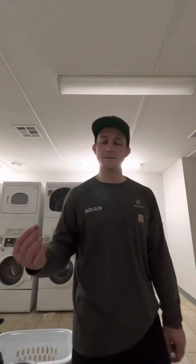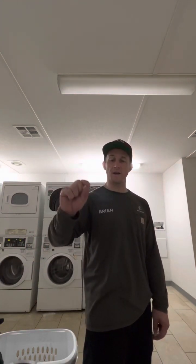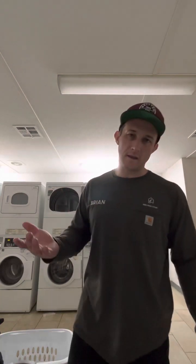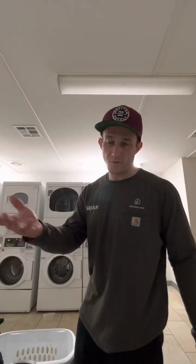Now do the same for the 120/240. Add it all up. Say you come up with 1,000 watts. You're going to do 1,000 divided by 240. That's your amperage; the answer will be your amperage. Document that and add the two amperages at the bottom. That's going to tell you if you need a 30 amp plug generator or a 50 amp.